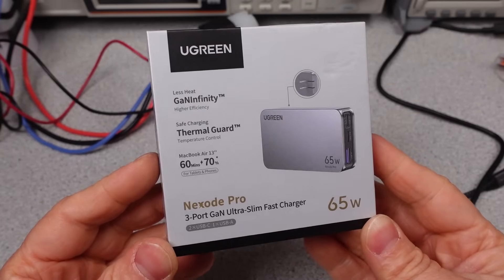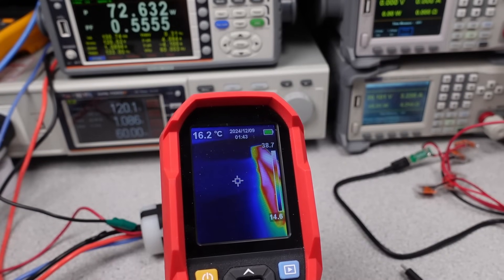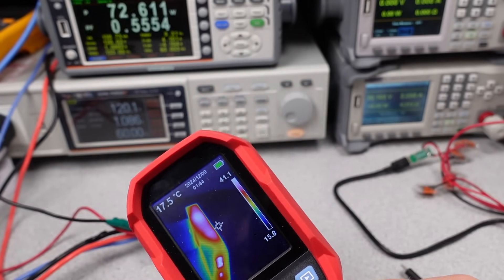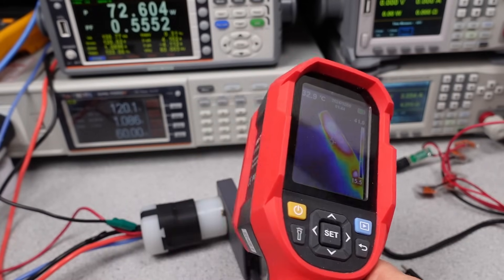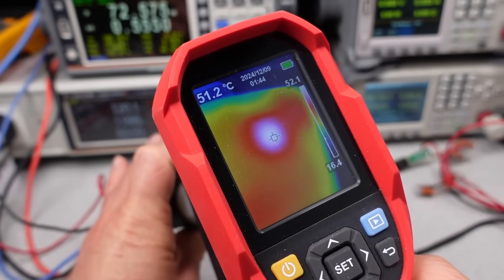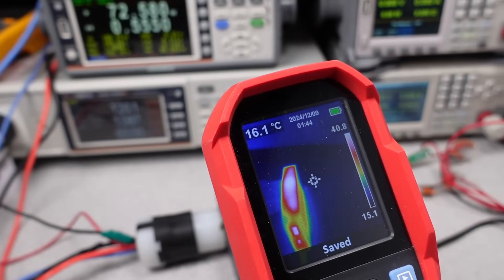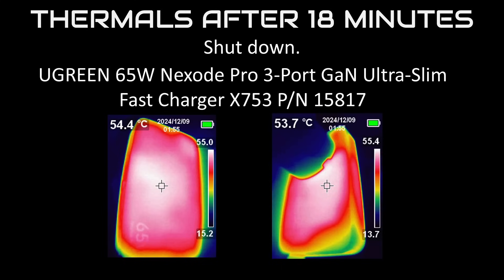Low efficiency leads to only one thing: thermal performance. The power adapter has to get quite a lot of heat out from a very lightweight and very small case. The lab is actually pretty cold today, so I'm giving this every advantage during testing. After a couple of minutes it's already starting to get warm. This lasted a grand total of 18 minutes. Users in reviews pointed this out as well, yet still gave it 4-plus stars — red flag. Low efficiency means heat. Don't expect it to work well if you want to get anywhere near its rated watts. They should call this what it is: a 30-watt power adapter, and not even a good one at that.